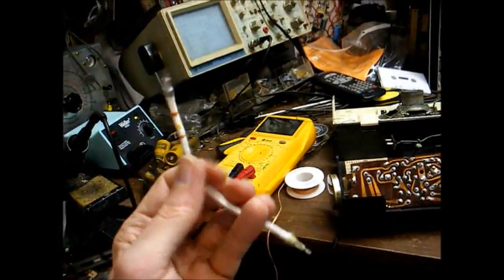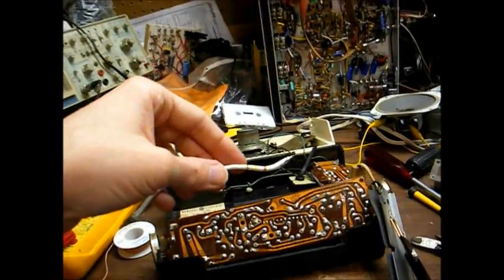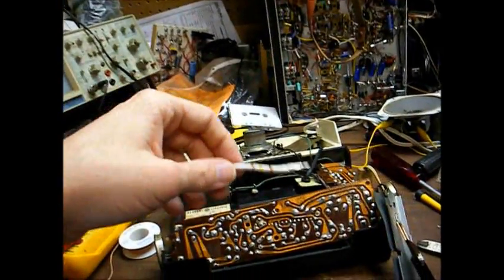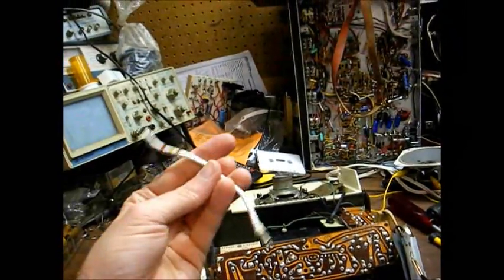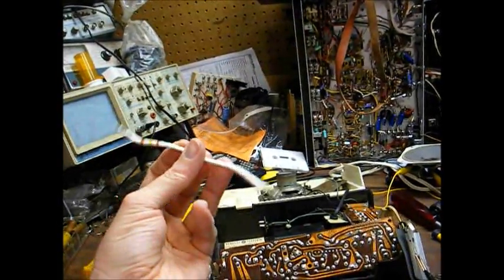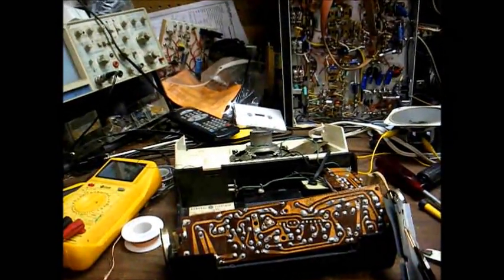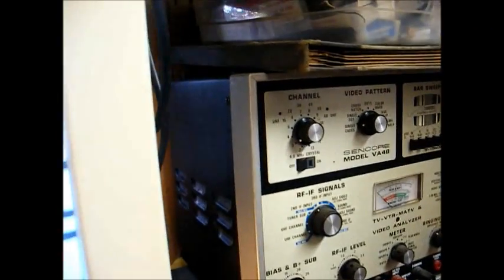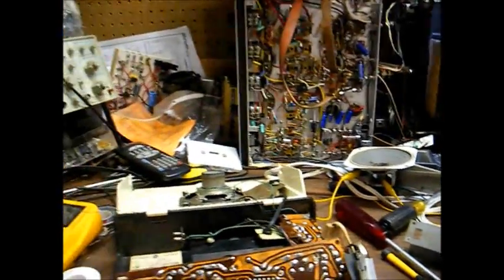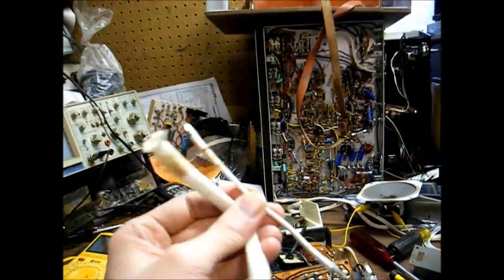This is what we call a flex resistor, and the reason they went with these is cases like this radio where they needed to fit a high-powered resistor into a tight space, so to speak. In today's world, I don't know if I can even get one of these resistors. I might have to go with a conventional power resistor and then come up with a creative way to mount it. I don't know how many watts this resistor is because the print on the schematic is really not that legible, but I can use Ohm's law to figure out a suitable wattage resistor to replace this with.